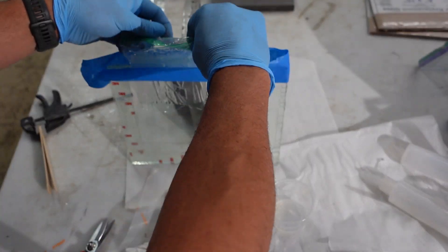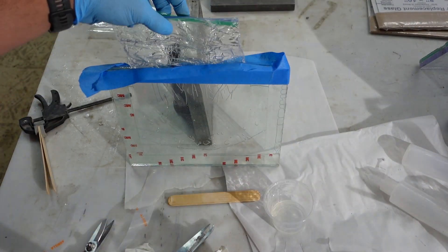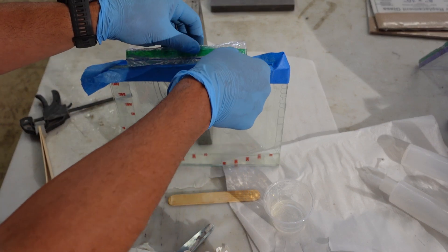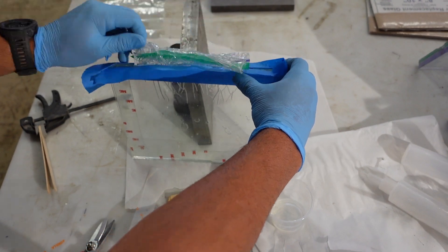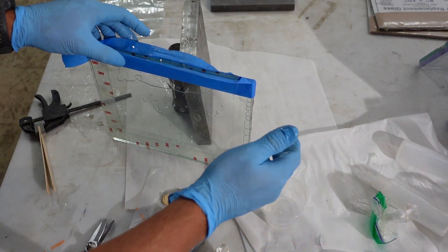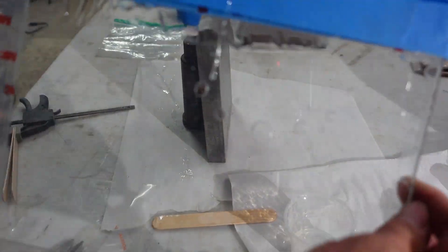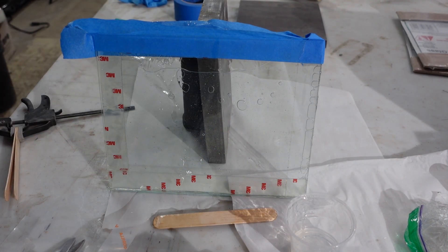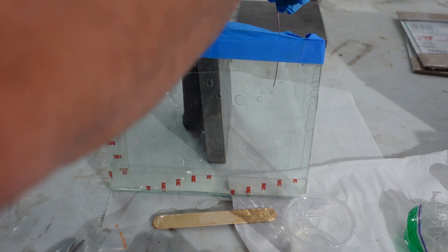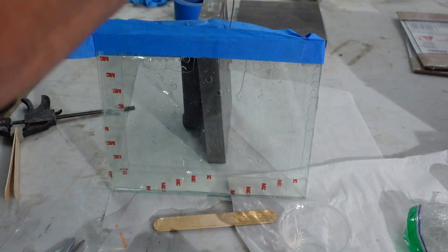We keep adding material and pushing until it squeezes in between the two panes of glass, continuing until everything is pushed through and the adhesive is nearly at the top. Then we remove the bag, which leaves a void. Along with that void there are a lot of entrapped bubbles. We've come up with a technique — taking a thin wire and guiding the bubbles straight to the top, creating an air path. It's a bit time-consuming so I'll speed this up.